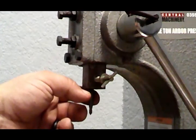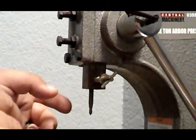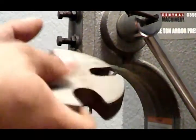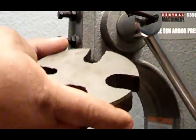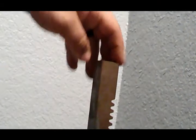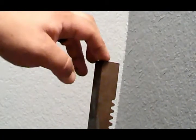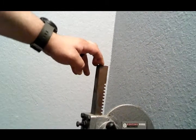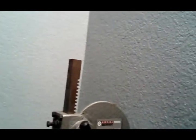And the way I set this up in the drill press was I ran the arm all the way down to where it rests on the bottom plate. And up here at the top, this is where the drill bit would be making contact, and you would want to step it up on this. You don't want to just simply run the drill bit through on your first size. You always want to step it up. That way it doesn't get hot. It's all clean and everything. And then of course it just simply comes apart to be able to flip it around.